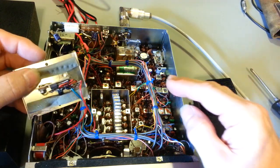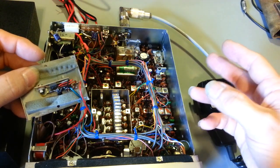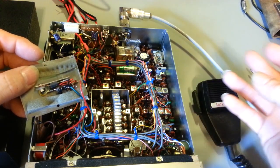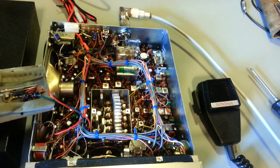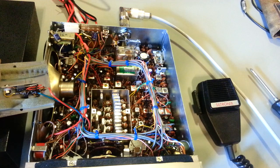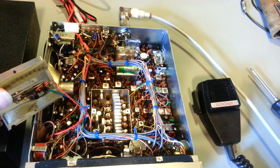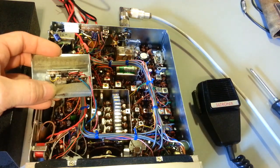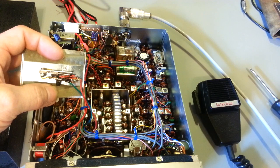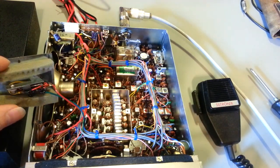Just like your radio may or may not have an SSB ALC circuit. It was in some radios, not in others. It's a lot of your earlier radios like this. They'd release something and then they'd come out with, we need to add a circuit in, and they'd add it in, and they'd find wherever they could stick it, and I guess that was a convenient place to put the error amp transistor and the regulator. But yeah, whatever, it works. But so you can see it is crystal synthesized.